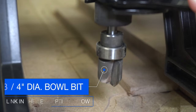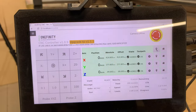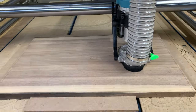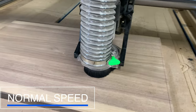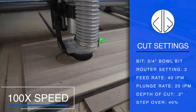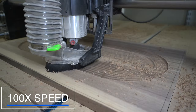With the piece flattened, I put a three-quarter-inch bowl bit in the router and ran the first toolpath — basically hogging out a whole bunch of material. The feed rate is going really slow: 40 inches per minute, plunge rate is 20, and I kept the step-over at 40%. After this first toolpath, it left a bunch of lines, which is to be expected when you're hogging out material with a 40% step-over. That's where the second toolpath comes into play.